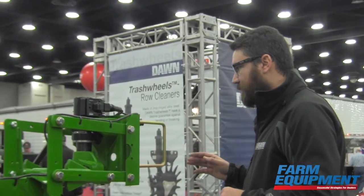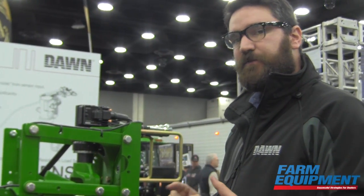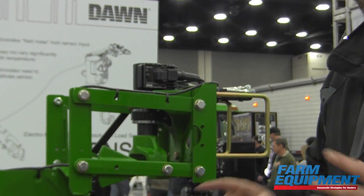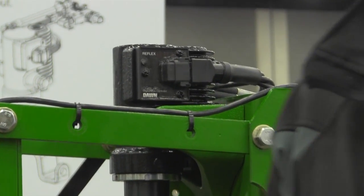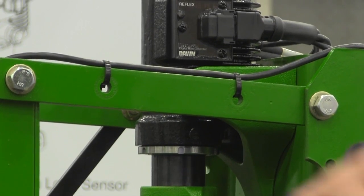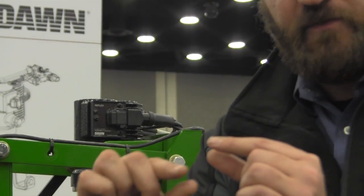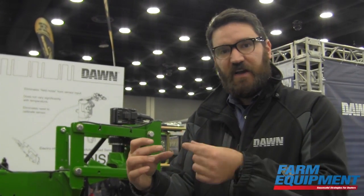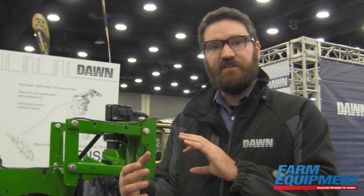The Reflex system is the first row crop device that is a digital hydraulic control device. When I say digital, I mean that most competitive hydraulic down pressure systems on the market use proportional control — running continuous electrical current through a coil, making a small piece move inside a valve, moving that valve against a spring to control pressure. In the real world there are complex effects inside those valves — edge effects and tight clearances susceptible to contamination.